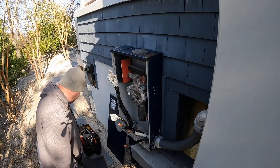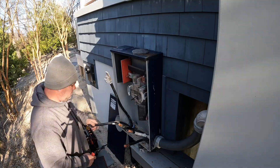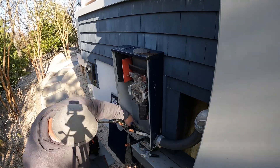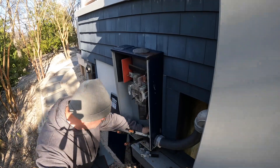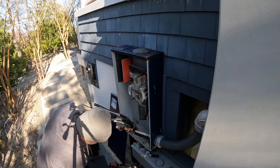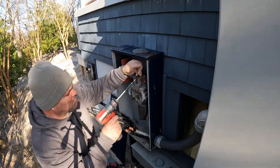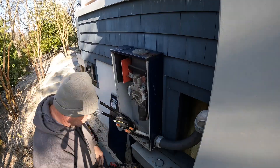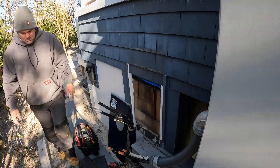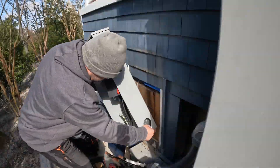So what do you do when you need to extend those conductors? I had to abruptly leave this job, go pick up the lugs, and get a splice kit with split bolt connectors — which you'll see me putting together in a second — just to extend the conductors to the line side connections of this underground meter. Before I did all that, the load side, which goes to a 400-amp Generac automatic transfer switch, had a lot of work just getting it off.